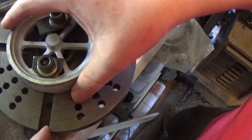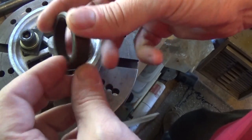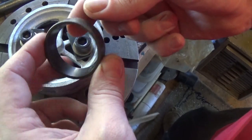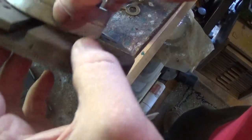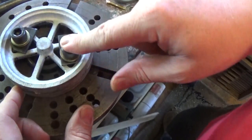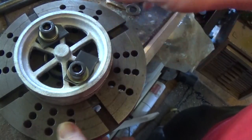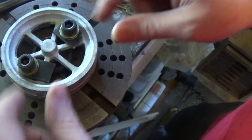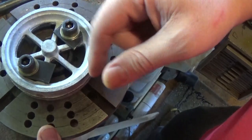I'm going to machine the flywheel, which is a nice zinc aluminium casting. What I've done is I've got a shell out of a tapered roller bearing — a nice ground parallel, really useful parallel spacer for a job like this. Put it in the centre and set this in. There is a gap there, not enough, but I haven't got long enough bolts to put another one in, so we're going to live with that. That's lined up somewhere near on these lines here. I've cut two little plates to go on there and made two nuts out of a piece of flat with a tapped hole to screw in. So that's bolted down nice and firm on the spokes, there's a gap all around, and it should be fairly easy to get it somewhere near on centre. So let's put it on the lathe.